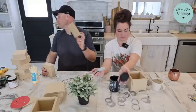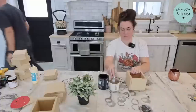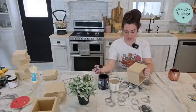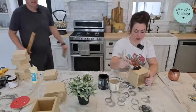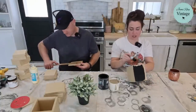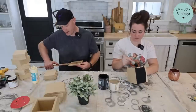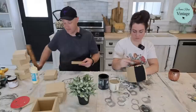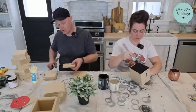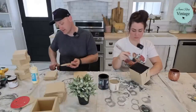If you want to duplicate this yourself, I think these are five and a quarter — let me double check. I'm getting this wet and going in my paint. You should pour your paint out — don't contaminate it like me. I'm just doing this so I don't use a ton of paint; it really makes it go farther. These are five and three-eighths on the bottom. Then my sides — this is all half-inch MDF — my sides are four and three-quarters by four and seven-eighths high.